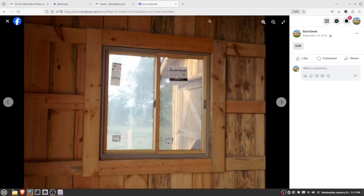You can see here the window framing is done with what I think is some 1x6 over top of the framing itself. What usually would happen is this top girt here, you would just continue it on across, and basically cut this center girt right there about 6 inches shy of the window on each side, and then put a 2x6 in there and frame it up. It's super simple to frame a window. You don't have to put a header or anything like that. A timber frame barn can handle that just fine. It doesn't need any structural support for the windows.